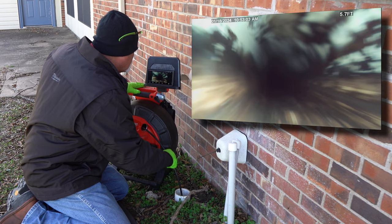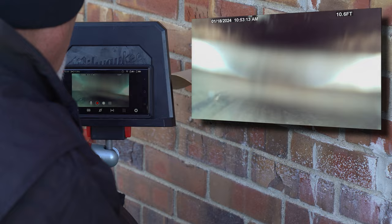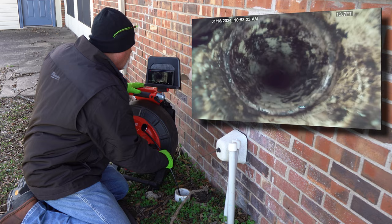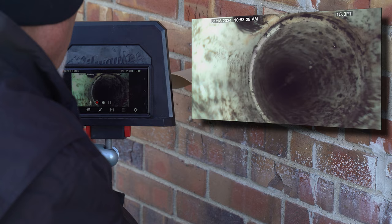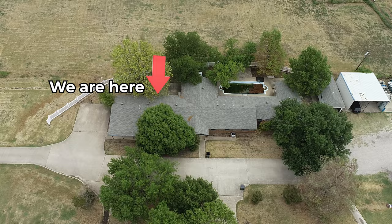We're going in and I don't see anything major. I do have some standing water, which isn't good - that tells me there's definitely some kind of back-fall. As you can see I'm starting to go underwater, which means it's falling in the wrong direction. I come into a 90 right here, which probably puts me at the bottom of my toilet. There's a smaller line branching off, and my bathroom is right about here with a shower in there, so that would make sense.